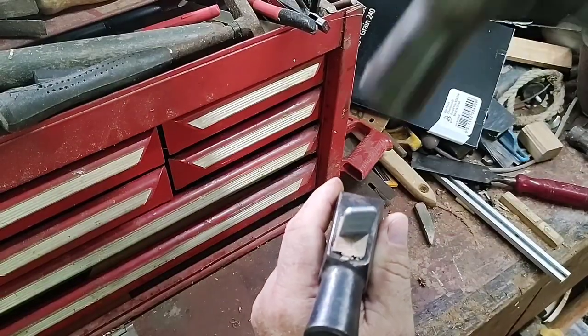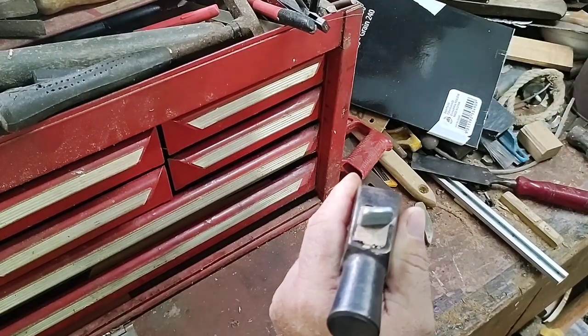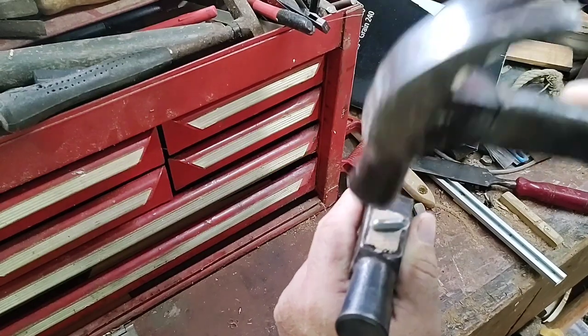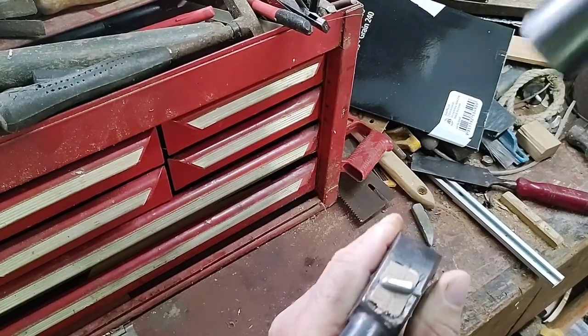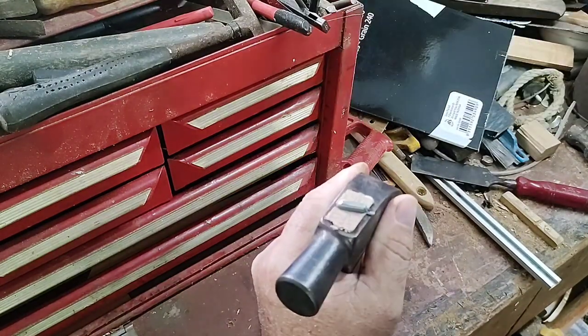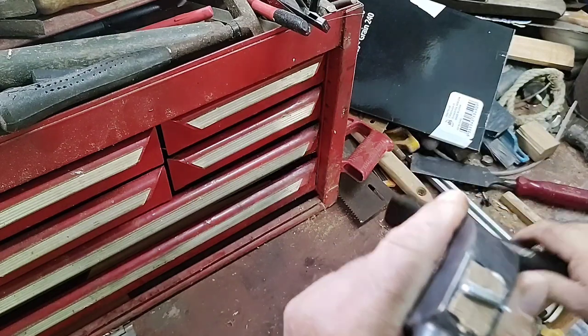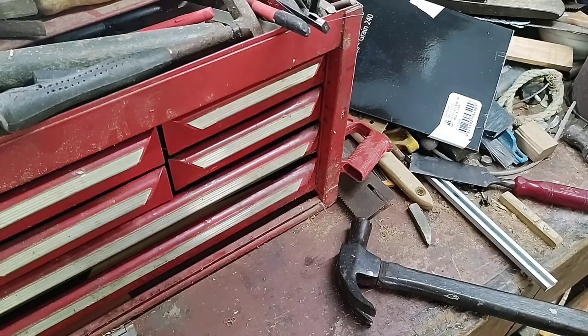After fitting the timber wedge, I drive the cross wedge, which is an aluminium cross wedge. It's a die cast sort of aluminium topper material. I drive it down tight, which spreads the top. Now the top of the eye on this particular claw hammer has a chip on one edge, so it doesn't look as though it squeezed it out properly, but it really has. And I'll show you that in a minute.